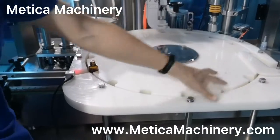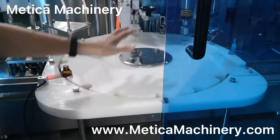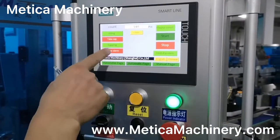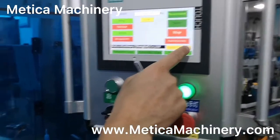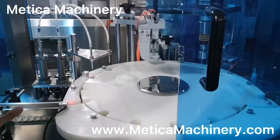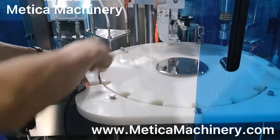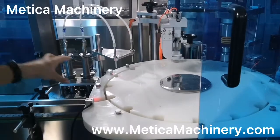The sensor here is used to control whether this star wheel is running or stopped. We have a function here, automatic page. It calls this function. Let's start the automatic reset. Start. Okay. Now the machine stops, because nothing is here. If something is here, it keeps running. Nothing means no bottles.